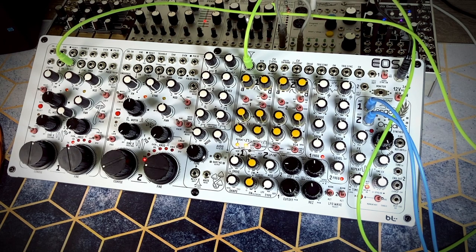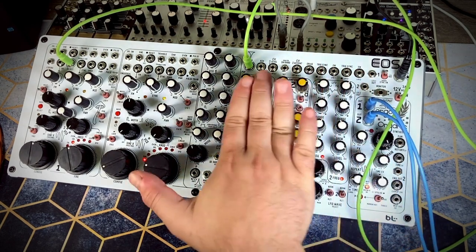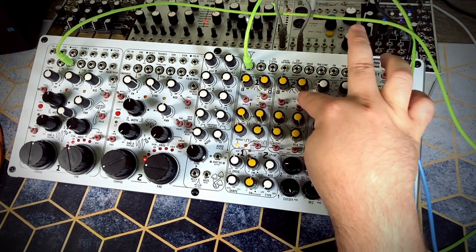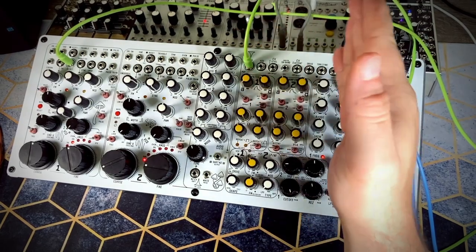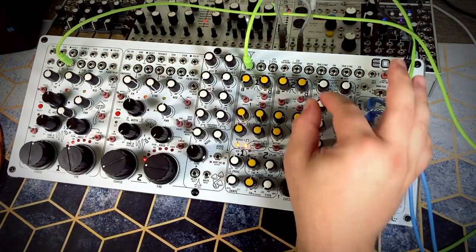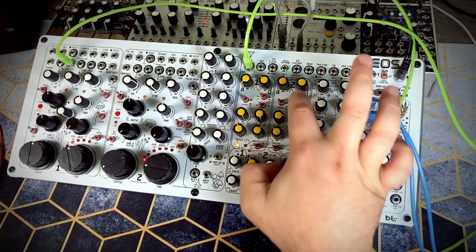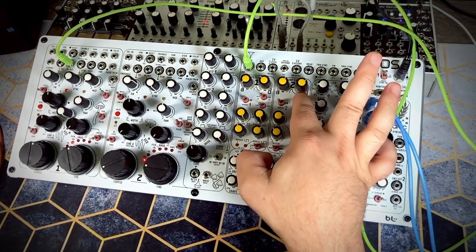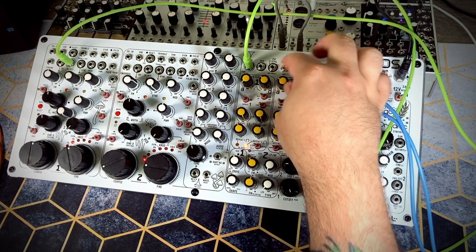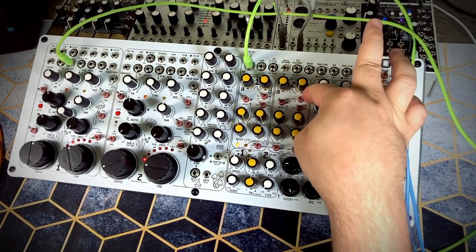I have a sequence coming into the EOS right now triggering our filter envelope and amp envelope. Let's focus on the amp envelope. We have our attack and decay, and right now it's set to trigger AD mode — every time it receives a trigger it does the full attack and decay. It is pretty short because it's mostly for percussion generation, but it gives a nice exponential curve. We also have short and long settings, and the gate AR section which turns this into an attack-sustain-release envelope. With trigger mode off it's just a pulse; with AD mode it gives us clicks or nothing without the gate.